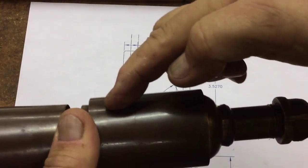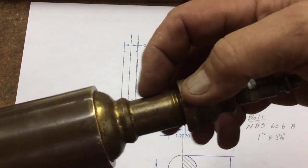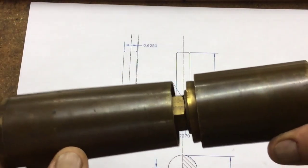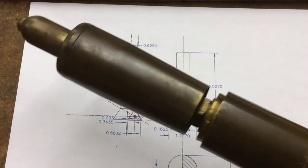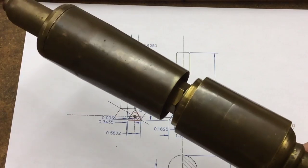This here was another piece of brass pipe with a solid piece that has air holes in it, silver soldered in. Same with this half inch brass pipe piece, silver soldered in. Limited resources on a ship — plenty of material, but just a lathe and a drill press, no milling machine. That's the detail on the air whistle. The dovetail cutter drawing worked really well, and the tool holder rack I'll just throw up a couple still pictures — pretty cut and dry, a lot of cutting and grinding and drilling. The dovetail cutter is pretty fun and pretty easy to make, should only take a few hours to get set up.